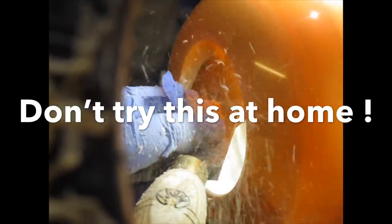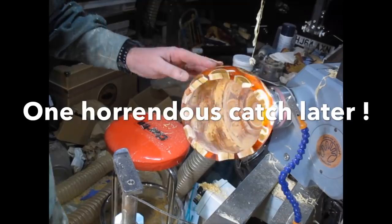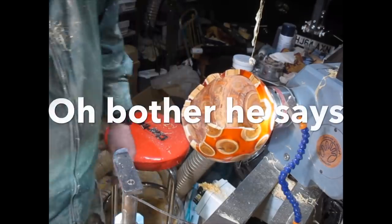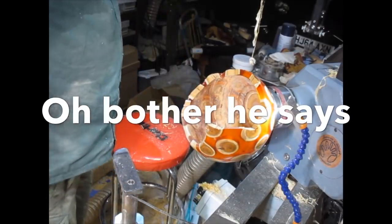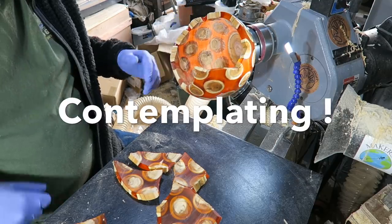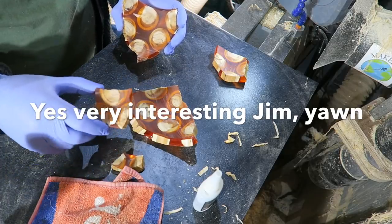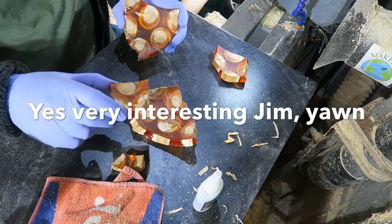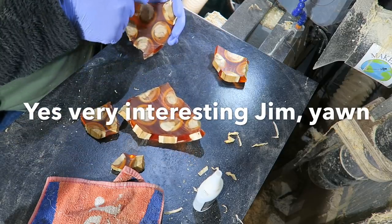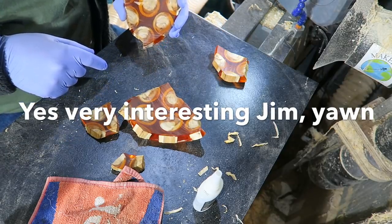Here I'm doing a dodgy manoeuvre — don't try this. I had a catch: caught the shaft of the tool on the rim of the bowl and it went bang. Unfortunately I turned my camera off because I was tired and was about to go in, thought I'd do just one more cut — and look what happened. Interesting how all the bits of wood have split through the pith — it's the line of weakness. The pith has dictated where all the cracks go, through every piece, which is quite amazing. The resin itself is so strong.